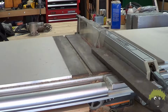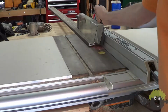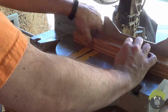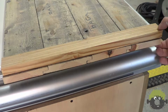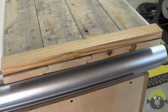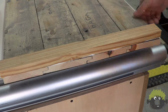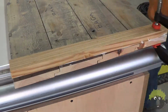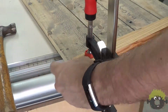I used a contrasting color of barnwood for the frame by just simply ripping a 1x4 in half. The half laps weren't milled very precisely, and the boards had some bow and twist to them. After glue up, there was a noticeable bow in the panel. To correct this, I just cut down a couple scraps of pine and glued them to the back of the panel to both stiffen it and help flatten it.